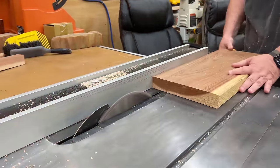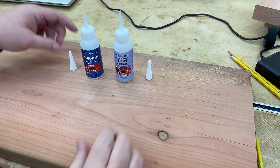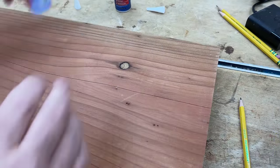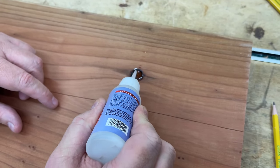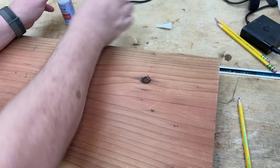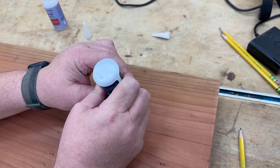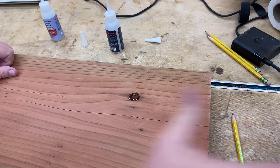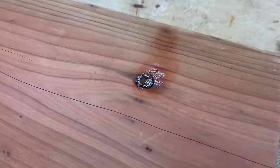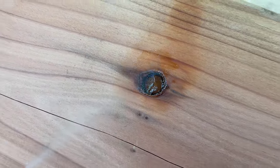We've got a few loose knot holes here. The tight ones I don't usually worry about, but if they're loose I like to seal them. I start with some thin CA glue — it's really thin and watery, it's just going to soak right in and get down deep into the joint. I'll follow up with some medium CA after that; this won't penetrate very deep because it's more viscous. It'll sit on the surface and then I'll hit it with some accelerator to cure it. I'll do that on both sides since this knot goes all the way through, let it dry, then sand it down. That'll make sure these knots don't fall out in the future.